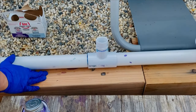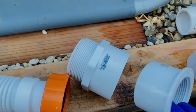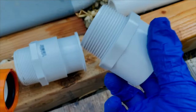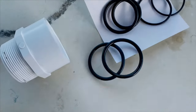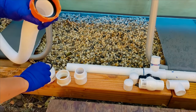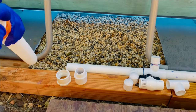Now we're all set up to connect the fountain, but first we have to connect the return PVC to the return hose. To do this you'll need a two inch adapter, a one and a half inch reducing adapter, a one and a half inch threaded to non-threaded adapter, and a two inch o-ring. Use the original o-ring and add one of the o-rings purchased from the store. The orange connector doesn't screw all the way into the adapter because we are going from metric to standard thread — it just won't fit, and therefore we need that second o-ring.